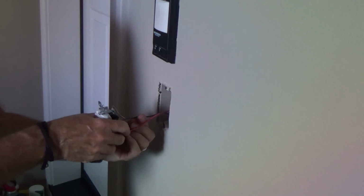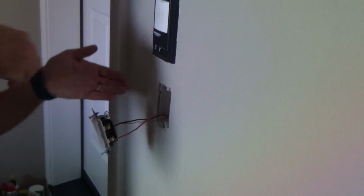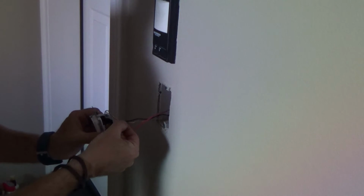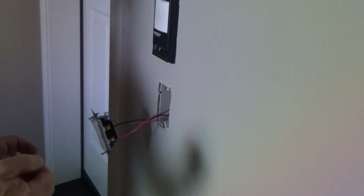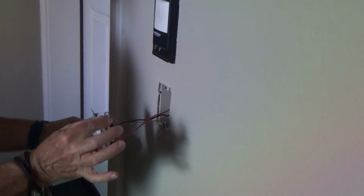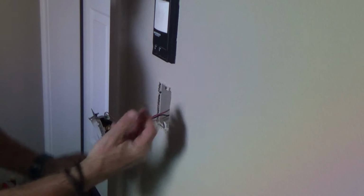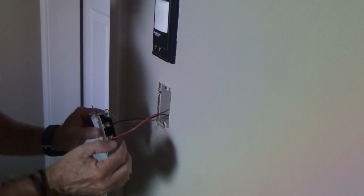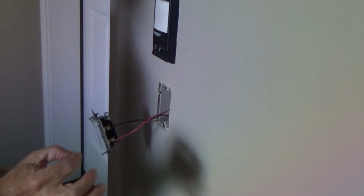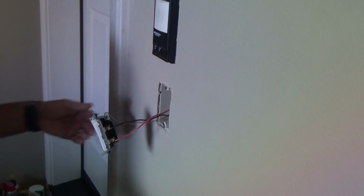But that's what you got so far if you're going to put it on the side screws. And lots of times that's what I do, because especially as you're wiggling it back and forth and getting it in there, and you think you have the wire tight in the back hole, maybe it loosens up a little bit, maybe it's still in there, just slightly not as tight as you want it. And every time you turn the light switch on, off, on, off, pretty soon maybe it gets a little bit loose, and you've got to have the electricity go from the wire to the screw or to the fitting in there, and pretty soon it might get loose a little bit. It might cause your breaker to trip or something like that.